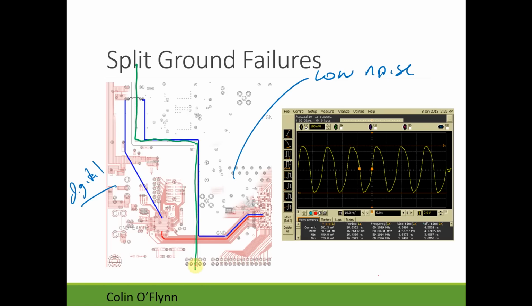And if you measure the voltage, here I have a scope probe connected to these two points. I'm measuring the voltage on what should be ground, so it should be the same voltage potential, and plotted it up here. You saw this huge waveform, and this waveform was the clock. One of the pins routing was a clock. And you can see it's 100 millivolts per division. I don't know if you can quite see, but it's like a 500 millivolt peak to peak waveform, which is not good when it should be at the same potential. And that's what happens if you do stuff like that: you're trying to use a split plane and then route traces across them. So the split plane can be useful, but you have to be very careful in some situations when you're using it.